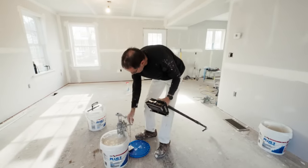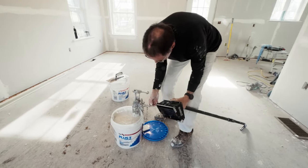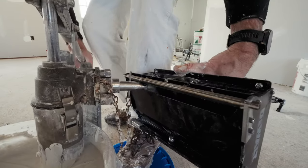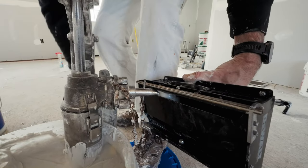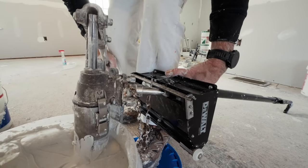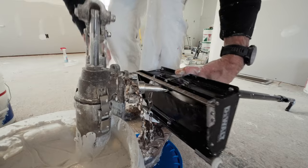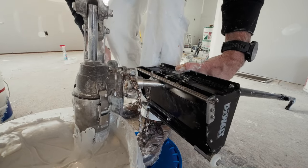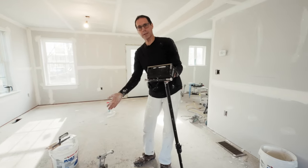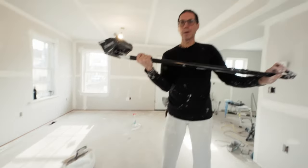This is the box filler hooked to my mud pump. So this is kind of compressed — that'll slide into the mouth of the box. I've got the handle pulled all the way back so that the whole box can be filled. I've got it pretty filled with compound that's quite thin, so I don't really want to tip this box upside down. I quickly put it that way and then I flip it.